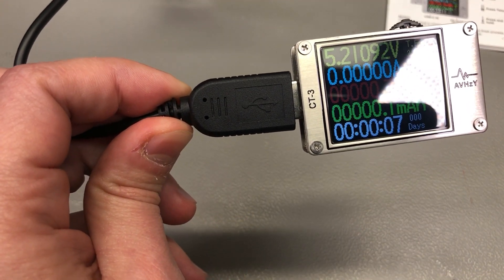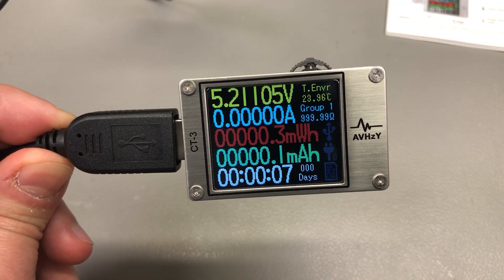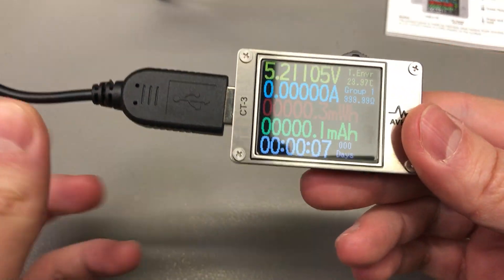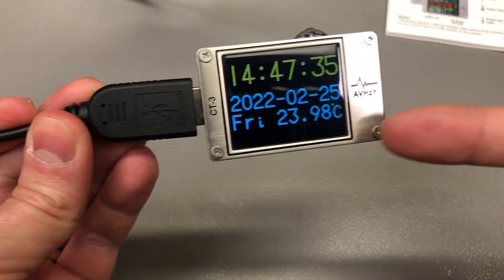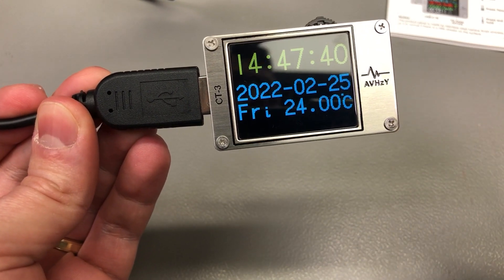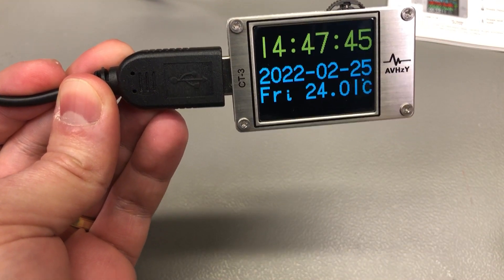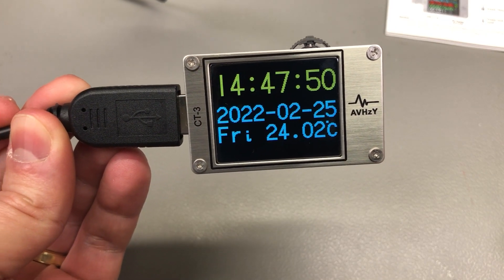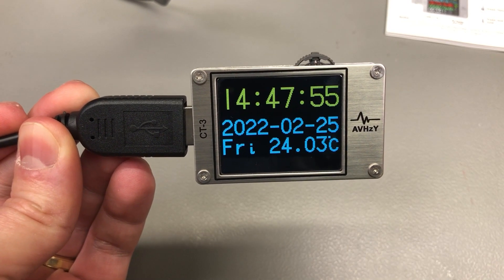It's also fair to mention that although this USB meter might work with USB 3.1 Gen 1 and Gen 2 pass-through, that is not guaranteed by spec because of the high-speed signaling on USB 3.1. The signal integrity does suffer a little going through the meter PCB, so not all devices will be compatible. By using high-quality short USB cables you might just have a working setup on USB 3.1, but if you're in the business of testing USB 3.1 devices you probably need to step up to professional equipment that will cost thousands of dollars.